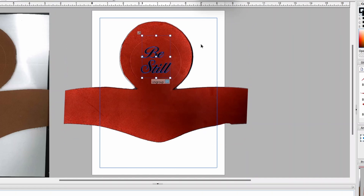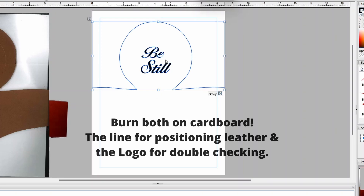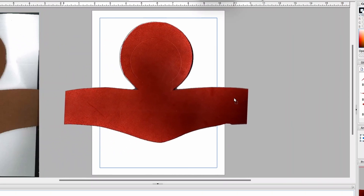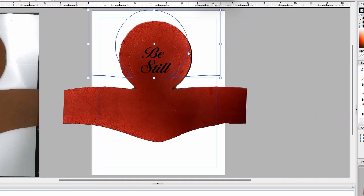So what's going to happen — when I go to LightBurn, all I'm going to send to LightBurn is this piece right here. That's all I'm going to output to LightBurn. And when I place that in LightBurn, I'm going to burn this into my scrap piece of cardboard. Then when I place the real piece of leather, I'm going to line it up like that. And when I engrave on this piece of leather, the only thing I'm going to engrave is the artwork, not the outline which I've used as my jig — not going to burn that.